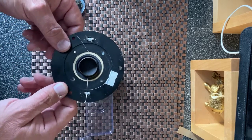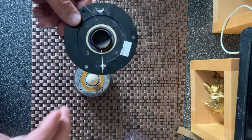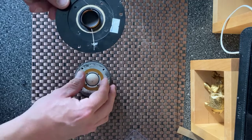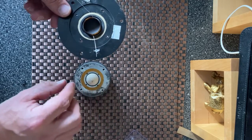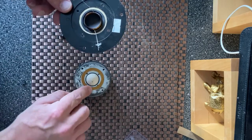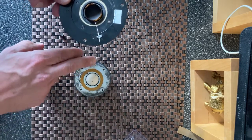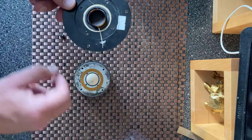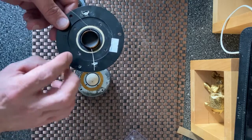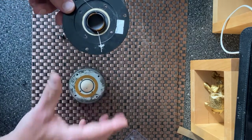So I'm just going to lay this in here for demonstration purposes. What I'll do is centralize this coil on here, and then using this gasket to isolate the wire from the gap, I run black tape right to the edge of the magnet which isolates the wires from this metal so they don't short out, and then you solder the lead wires to the terminals and put this back together.